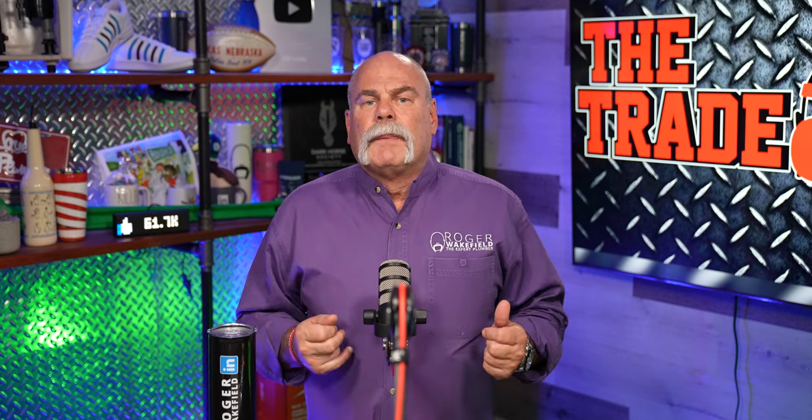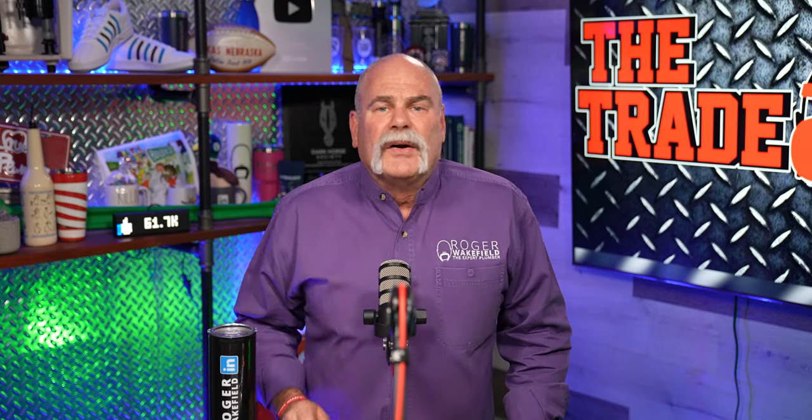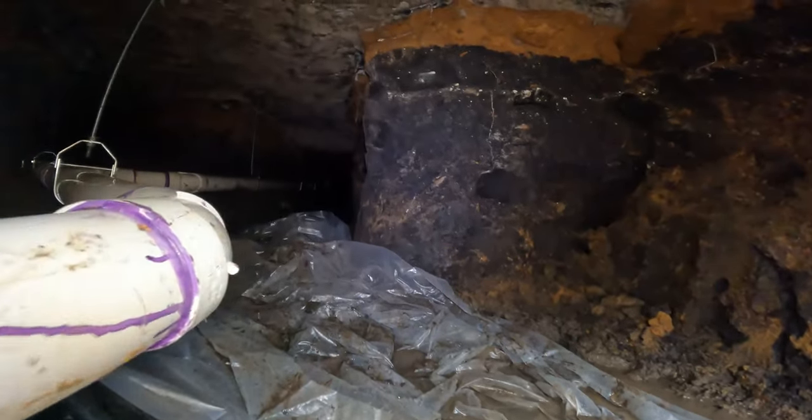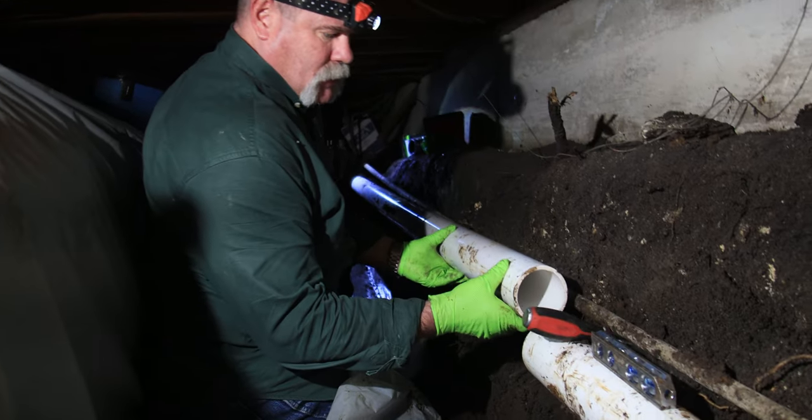When it comes to backfilling, you want to look at the safety for backfilling — it's almost exactly like when they're digging the tunnel. They need to make sure that the sides are kept straight. Here in Texas, we've got a black clay-type earth that the houses are set on, and it's packed pretty tight, so we normally don't have to worry about any sloughing off because of the way we dig the ditches. Our ditches are normally about three feet deep and they are square. I'm not a small guy, and they're normally dug big enough and good enough that we can get in and actually work two people side by side, or we can actually pass each other in a tunnel under the house.